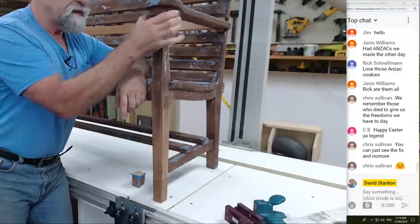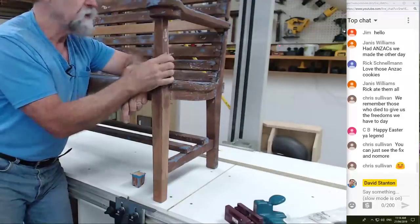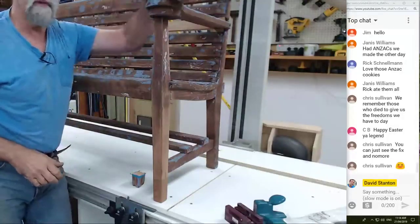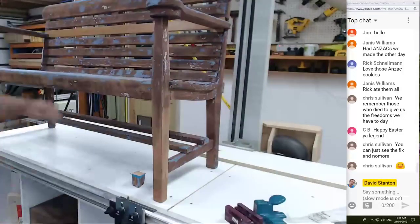So this is held onto that via a tenon and also a screw to stop it lifting. And then this has got the three screws holding that, and that stops any moisture coming down through here and decaying the timber. Very, very clever. All right, so that's that.